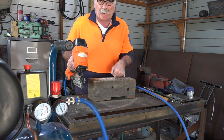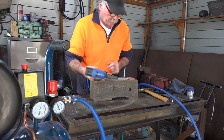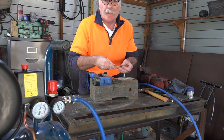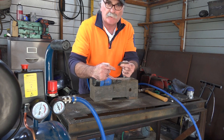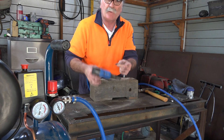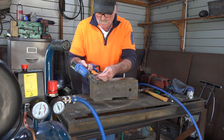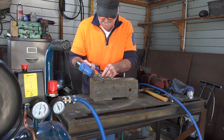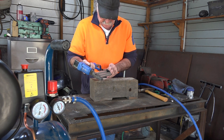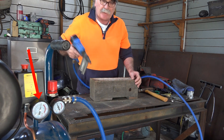What we'll do now is I'll show you a little staple gun and we'll see how long that goes before this thing clicks on again. Now we've got a little pin stapler thing here - it's ideal for skirting board or architrave and that sort of thing. These pins are about two and a half, three inches long - they're like pins. They don't go round like staples, they just go in like a pin. We'll chuck some of these in here and see how long we can go. You can buy these guns anywhere online, they're a dime a dozen. I don't buy branded stuff because I'm miserable. Alrighty, you can see we're full of air again, so let's see how long we can do this for.